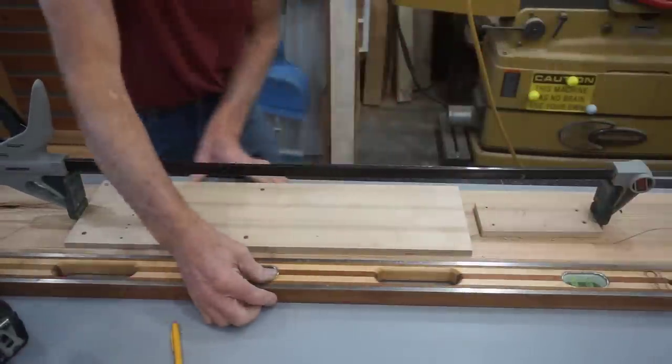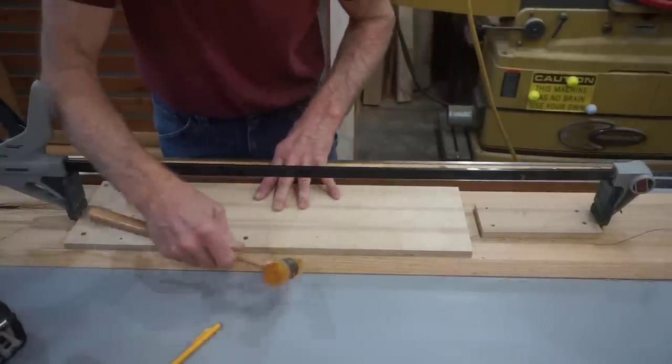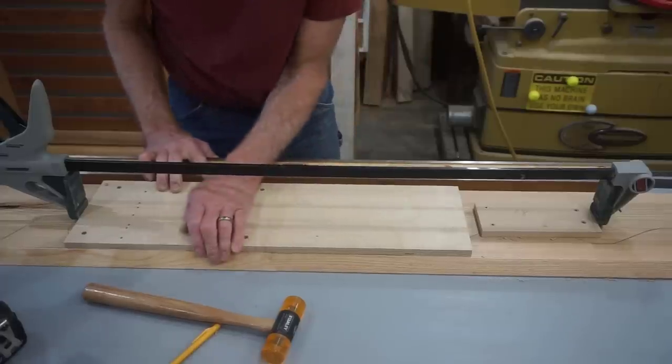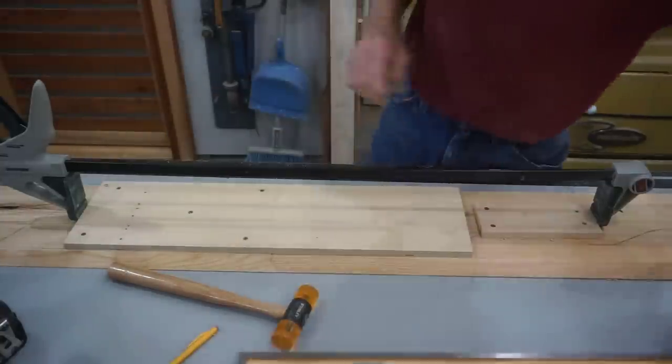With pressure applied, I use the 4-foot level one more time to make sure the edge is straight and do a little bit of tapping to align the bevels on each side of the bottom boards. And this step in the process highlights the importance of good consistent milling to make sure that these bottom boards are the exact same width so that there's not a step in the board at the joint.